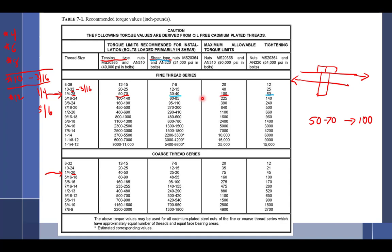And so when you're pulling on it, you're measuring how much twist you're putting on it. Stop and think about that. Who cares how much twist you're putting on it, right? That's meaningless in a sense. When an engineer designed the bolt and how it was supposed to go together, the last thing the engineer really cared about was how much you're twisting it this way. That's actually a bad thing to be twisting it. What the thought is, is how much you are stretching the bolt.